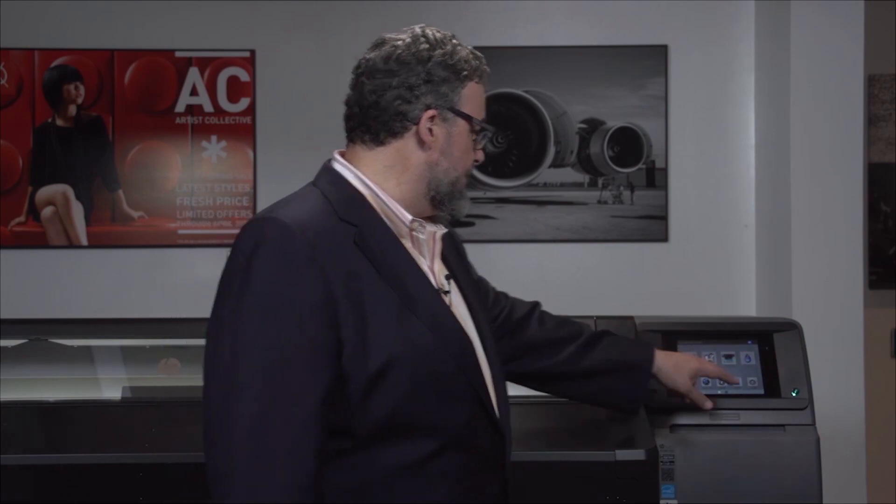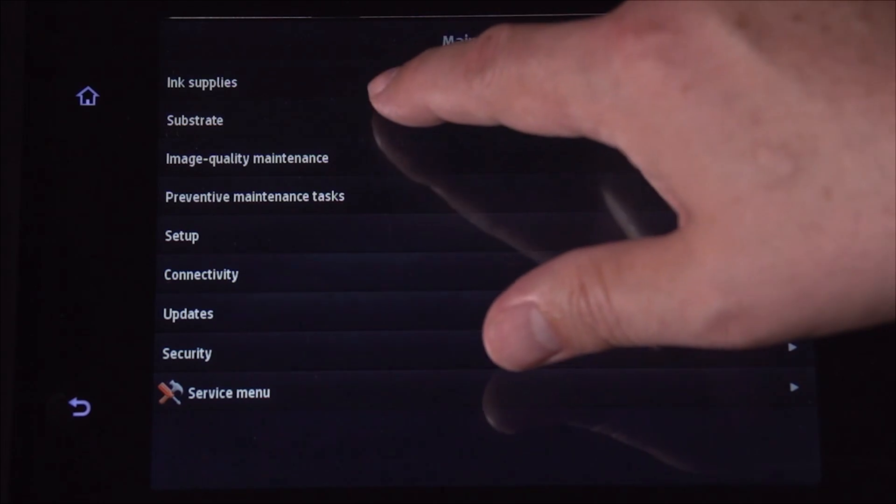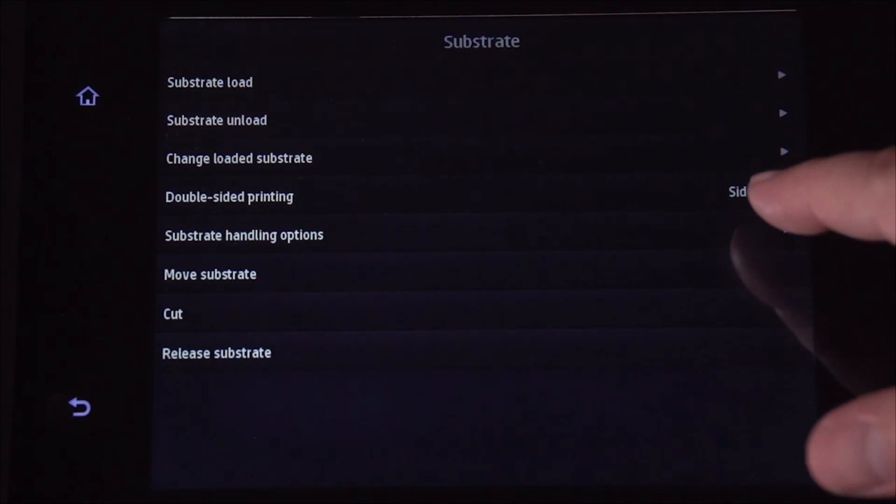You have to keep track of that, because Onyx will try to go in the order they were queued. It wants to do them 1 through 10, and then do them 10 through 1 backward because it wants to line them up. What you're trying to do is swap that order, so you have to remember to do that. I put this right on the take-up roll — at 38 inches, it goes right on. I can see my little mark, and I know it is behind the OMAS and ready to go. I'm going to go to settings, tell it substrate, double-sided printing, you are now Side B, and go back. Onyx has already said it sees it — do you want to print Side B — and I'll go say yes. The line should run right into the OMAS, it'll see the black line, and Side B is going to start printing.